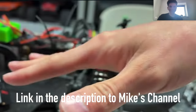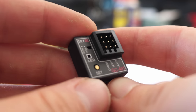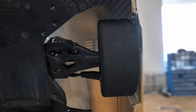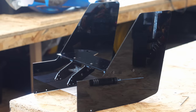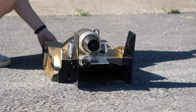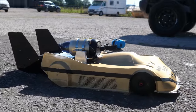I also got help from a few viewers. Michael Stallone, another YouTuber, gave me some suggestions for how to set up my suspension — stiffening it with short lengths of fuel tubing. One thing everyone wanted to see after the last video was a gyro, so I decided to try one out. A gyro corrects the wheels automatically: it senses the direction of the car and adjusts the steering output to keep the tyres straight. I'd never used a gyro before and was going to have to use it for the first time at the airfield. The rear fins, which had worked well up to 100 miles an hour, were kept the same but with slightly stiffer custom 3D printed brackets.